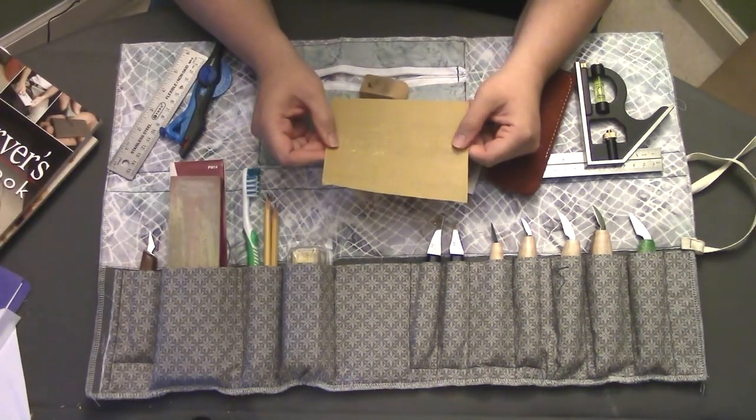I keep a piece of sandpaper, 220 grit, close by when I prep my board. I found using anything less than 220 grit would actually leave scratch marks in the wood. And when you lay your board out, graphite gets caught in those scratches, which makes it very challenging to remove later. It can unfortunately lead to drastic measures in regards to trying to remove those lines after you finish carving, and you can actually damage what you're trying to work on.